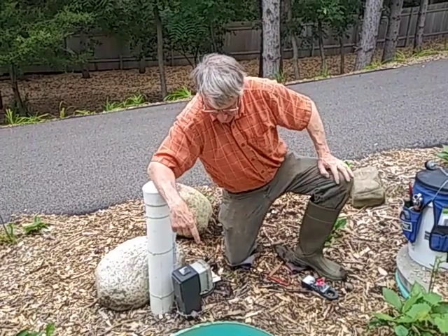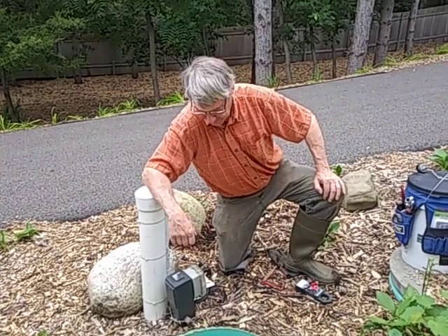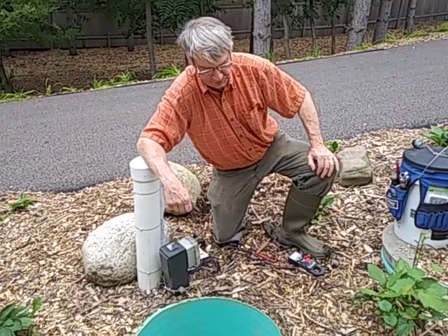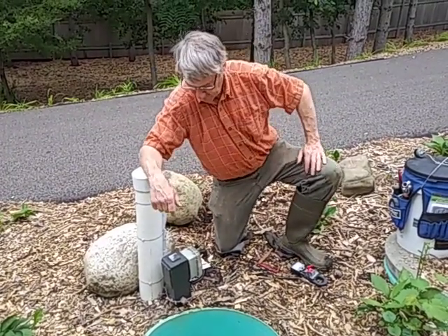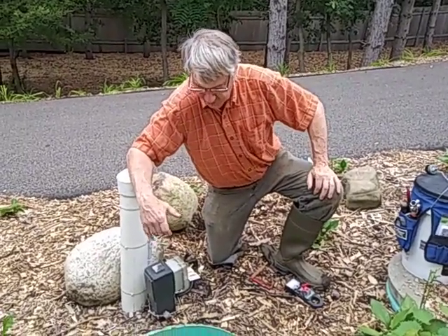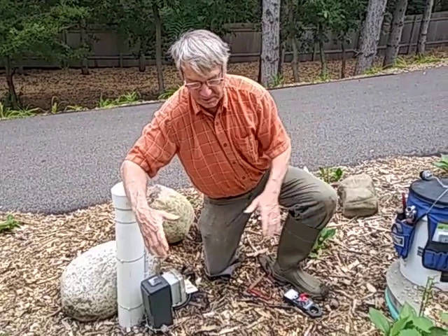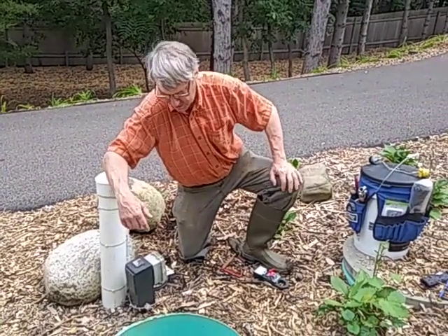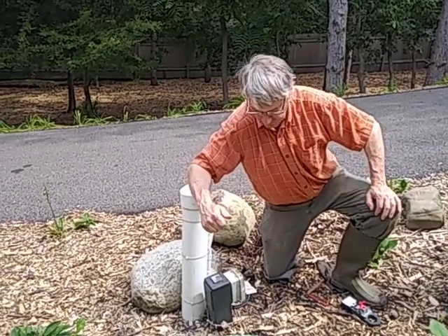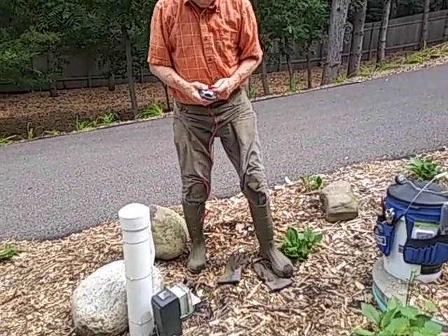No, that's the work of a guy who's been doing this for about 50 years. Years ago, the Fernco couplings would blow apart from the pressure, so we quit doing that. Then they came up with beautiful screw-on couplings, but the O-rings weren't properly retained and you'd end up dropping the O-ring. I'd get a half dozen O-rings as spares, but then that model went out and they came with another model — all with different size O-rings. So finally I thought: when the pump goes, we'll cut it off, replace it, and save the hassle of poor couplings.